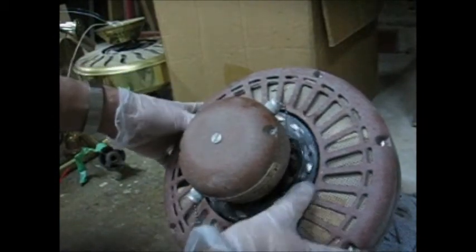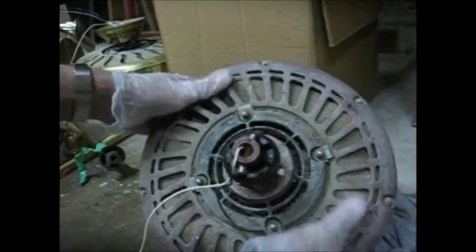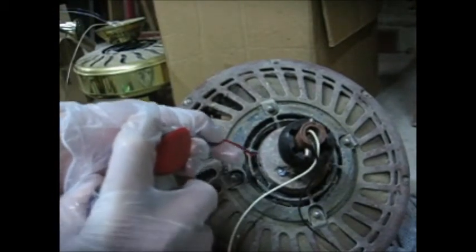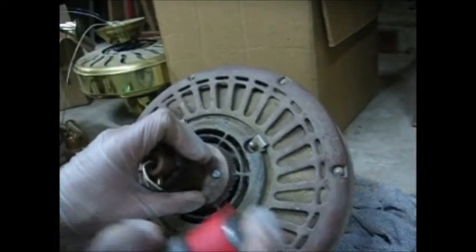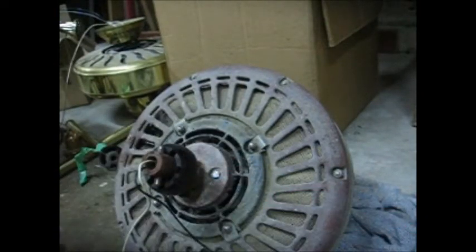And that's how it frees up a little bit — moves more freely. So here's a little bit of bearing noise, but now we'll turn it over to the other side. As you can see, it's a gunky mess — it's been hung outdoors. Just kind of go through these grooves right there. Just put it in there with that little straw until it doesn't really go down any further. You should only use WD-40 when it's gummed up really bad, because WD-40 itself can just gum off the bearings — it's a detergent-based oil.